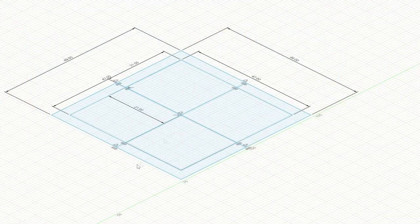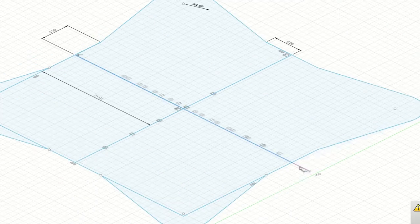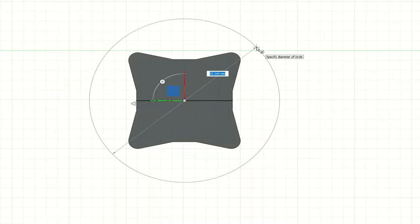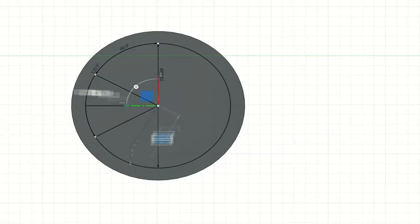We start this process by measuring up both the wheel interface and the motor drive interface. We then make a CAD template. No, not using cardboard aided design, but using a modern thing called computer aided design. Any CAD package will suffice for this bit, and we start off with a 2D representation of the shape. We then extrude and cut material away until we get the shape we require.